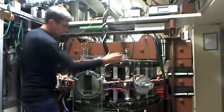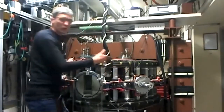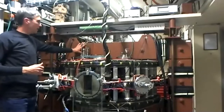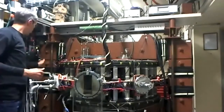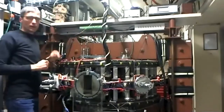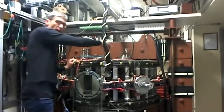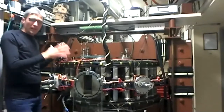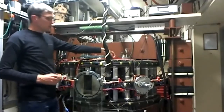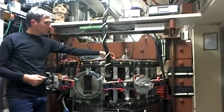You can see aluminum boxes containing the coils for toroidal magnetic field generation, and here we have the transformer core with the primary coils. That system generates the magnetic flux directed toward the central column of the transformer, and the time change of this magnetic flux generates the electric field. That is the basic technology of the tokamak.